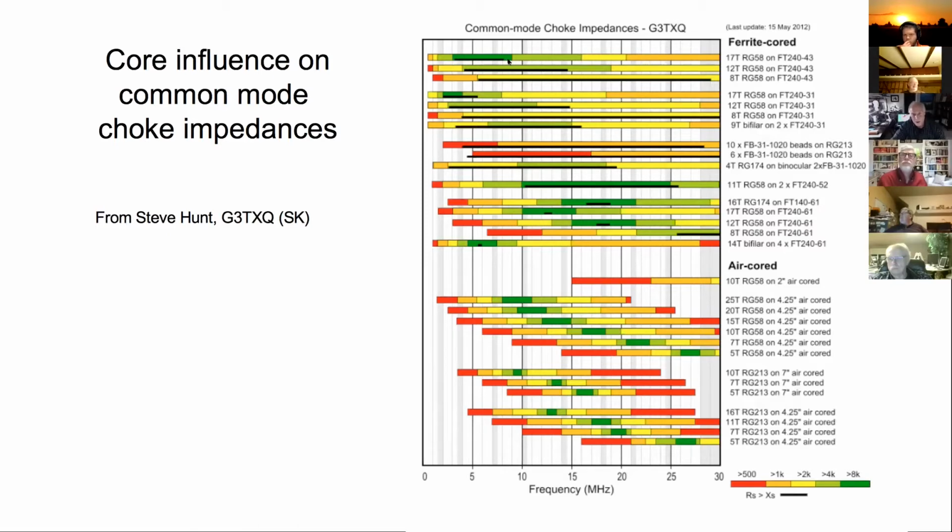I'll tell you the difference between a... okay, I'm sorry, I'm using the word reactance. I should say impedance. There's a reactive impedance and there's a resistive impedance. What we want mostly, if we can, is resistive impedance, not so much reactive impedance. Resistive impedance means you get mostly dissipative impedance and it's flat with frequency, whereas reactive impedance varies with frequency and it can disappear on you.